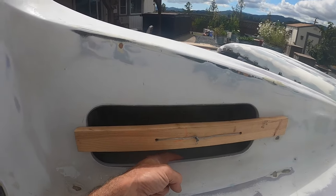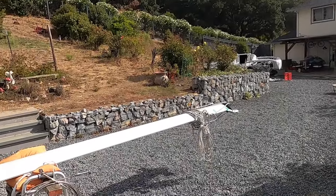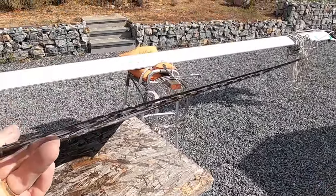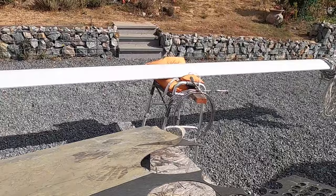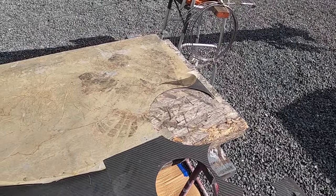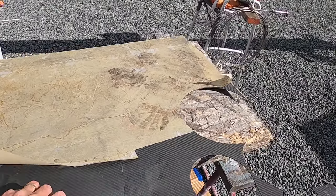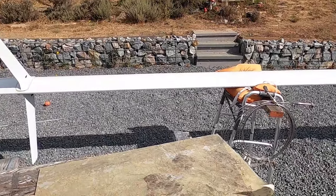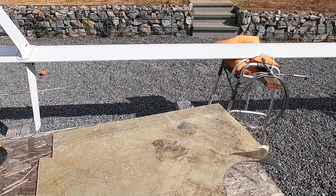I'll be glassing right where my finger's going. On to tabbing that. This is a really nice piece of carbon sort of utility board. Whoever made this did vacuum bagging just with some layers of 45-45 — super strong, very light. I've been making shapes and things out of it. I cut out just now about 10 little landing pads to put all of the deck hardware on. Let's go install those.